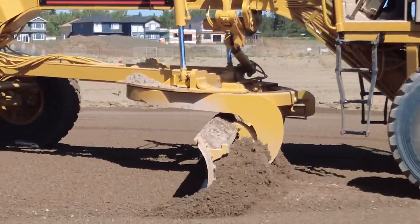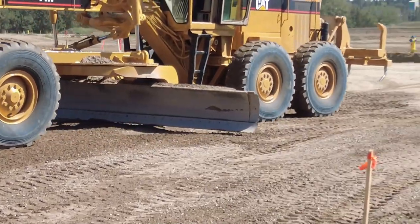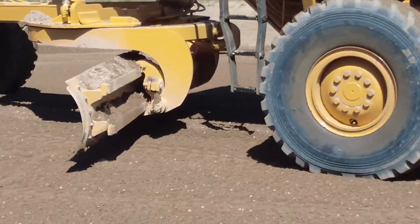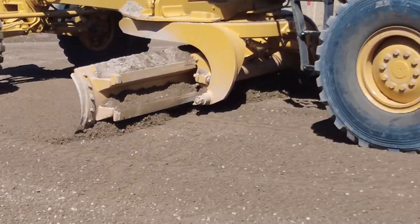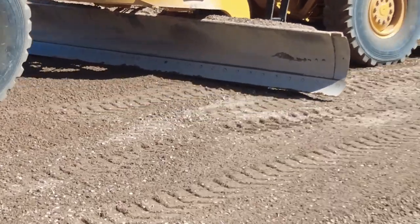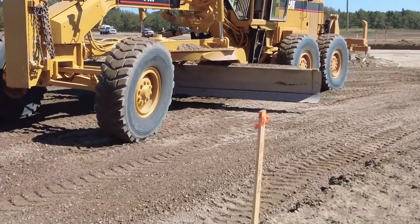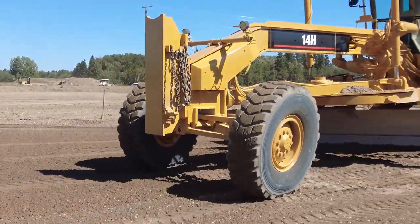Here I am back blading the crown — I'm probably lifting up a little bit there just to leave a little bit at the crown. Back into the neck. I really enjoy working on these bubbles; they're a pleasurable thing to do, actually fun. There, now that bubble will be at least roughed in — roughly on grade. We've got to put string line on it and put the curb on it yet, but that's basically how I would shape up a bubble. I hope you enjoyed the video — please subscribe and like, and we will see you next time.